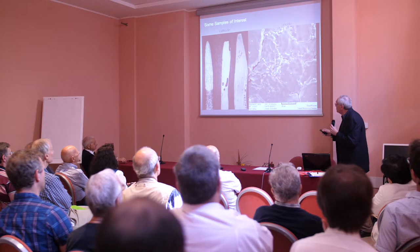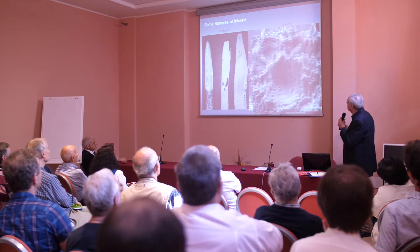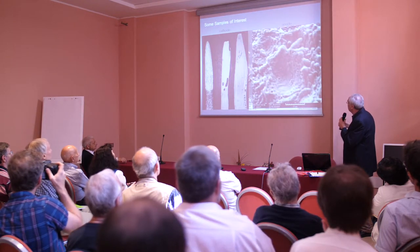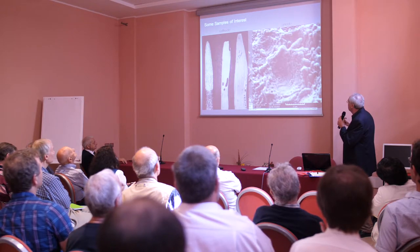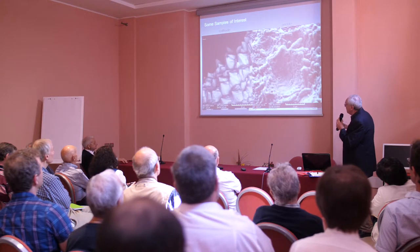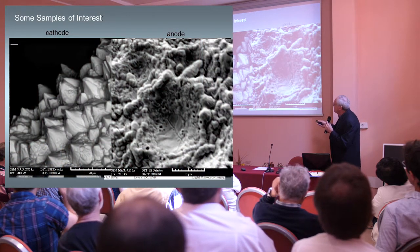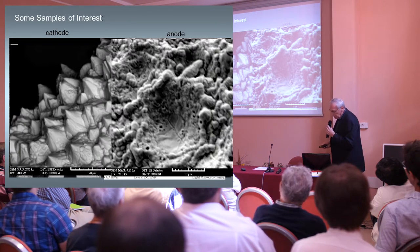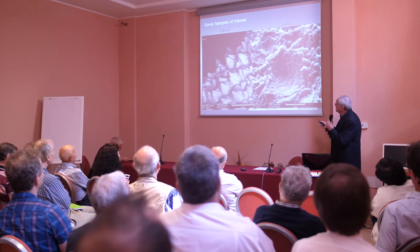This is just some microstructure from one of the anodes. You can see cracks — Ed loves these cracks — and some little fissures and holes from the anodes. Those are probably just outgassing of the deuterium. And this is what the cathode looks like — the cathode's been eroded with these little pyramidal structures all over it. This is pretty standard stuff for plasma etching.